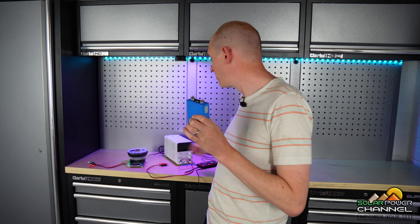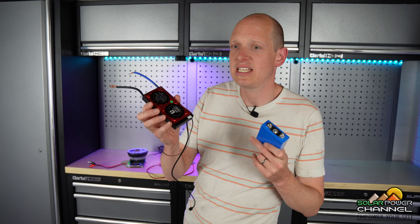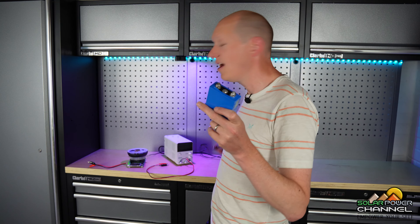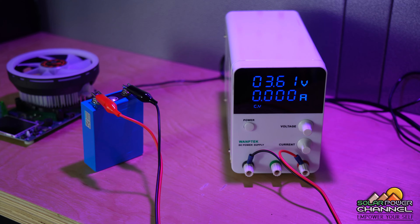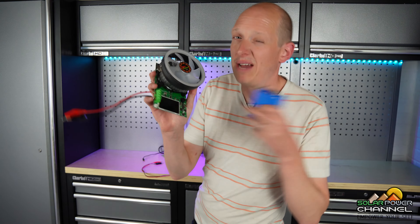Now with this battery here we normally do a disconnect at two and a half volts. That is done by these BMSs — they do high and low voltage disconnects, as well as high and low temperature disconnects to look after these. But I'll be doing something without using a BMS. I'll be using my power supply unit here, setting it to 3.6 volts, and I'll know when it's fully charged because it will tell me when the current stops going in. And to do a capacity test I'll be using my trusty capacity tester here.